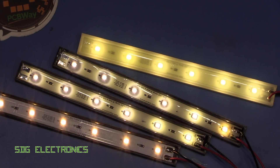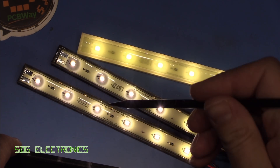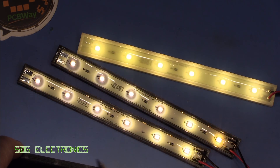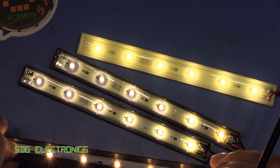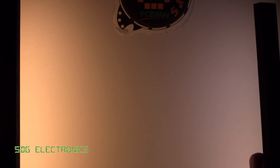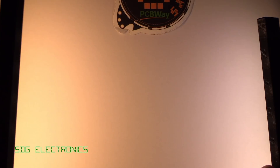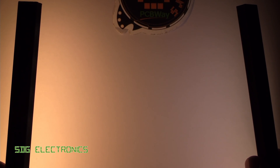What I'm going to do is get the spectrometer and shine these onto a piece of white paper, with the optic fibre pointing at the paper, so we get a good reading overall of the spectrum coming off these LEDs. Here's just another illustration - we've got some white paper, with the one with the resin and the one without. There is really quite a significant difference. It looks really cool white here and nice and warm white on the left.